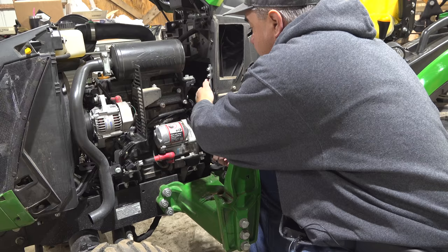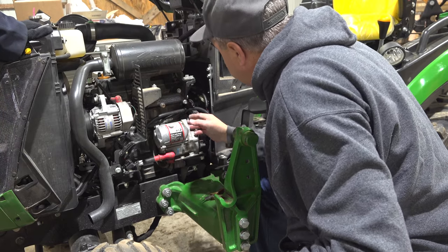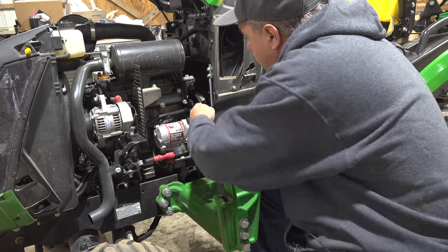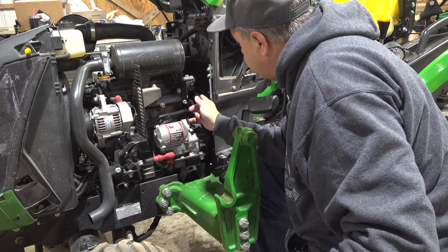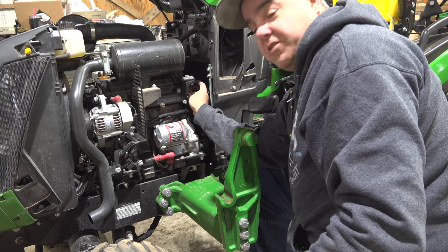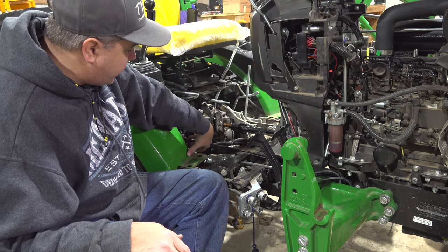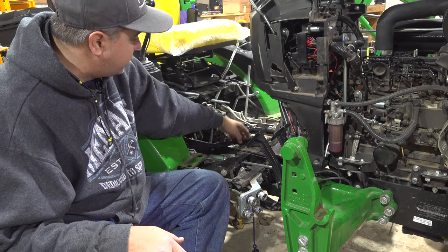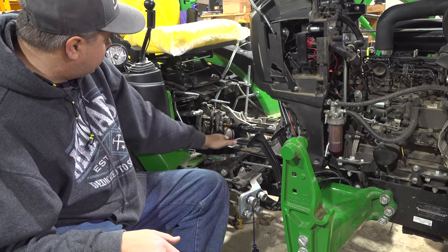As I was saying earlier, there's a lot more space in here. The first time I had a hard time wiring this little pigtail in there, but this time I just reached in with both hands and wired it right up — no problem at all. Makes me wonder what they removed. We had trouble going across the engine last time with this particular harness. Check out the original TKV-20 installation video to see how that pigtail fits in to get power right there — it was very difficult on the other tractor. It's easy here. This is an amazing amount of space. With the Artillion diverter kit I stayed on the outside of the frame; with the TKV-20 I'm doing the opposite approach, coming down inside and staying on the inside of the frame. I zip-tied this right to the existing wiring harness that goes to the back of the tractor. There's even a clip where I took the bolt out, slid this harness in, and went right on back to the rear of the tractor, up the ROPS, with the resulting connector right here.